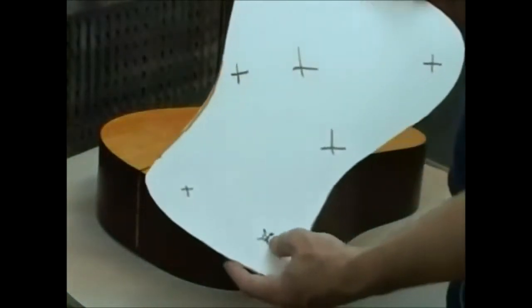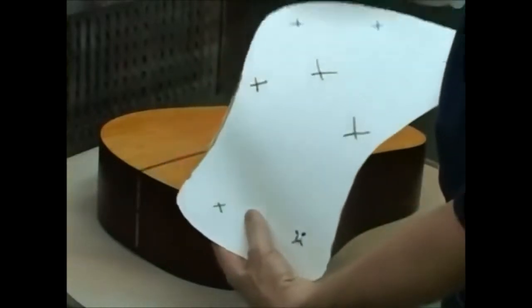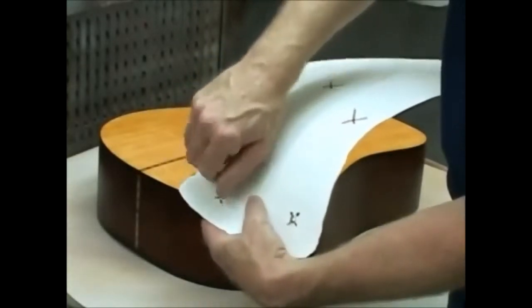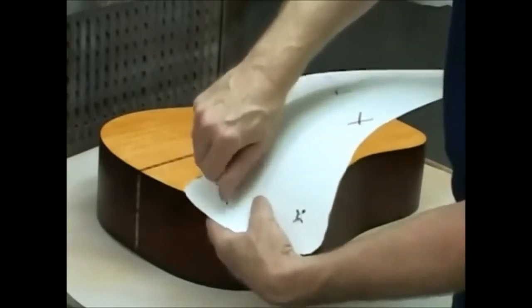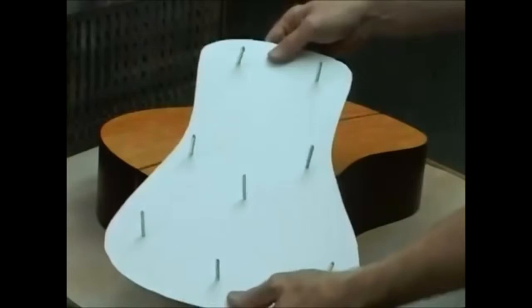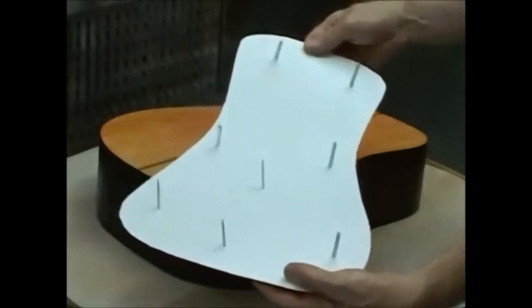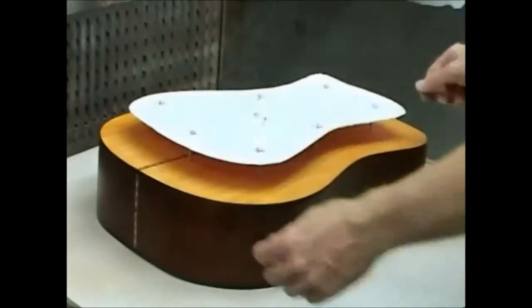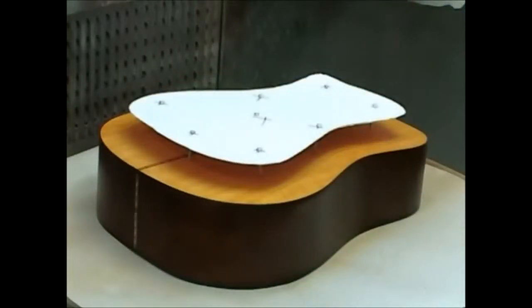The back is now ready for the sunburst effect. We cut a piece of poster board to serve as a template for applying the sunburst. The template should be positioned about two inches above the surface of the guitar. We're inserting two-inch screws into the cardboard where each X is drawn. The template is then placed screws-down on the guitar, holding it two inches over the surface and exposing two inches around the edge for applying the sunburst. The purpose of the template is to keep the width of the sunburst equal all the way around the perimeter and to keep the center of the guitar clean of the darker color.